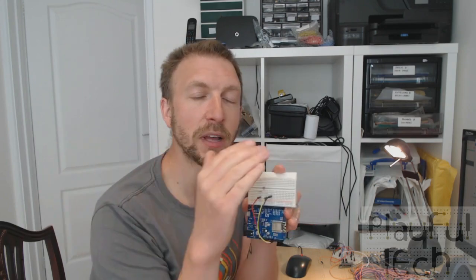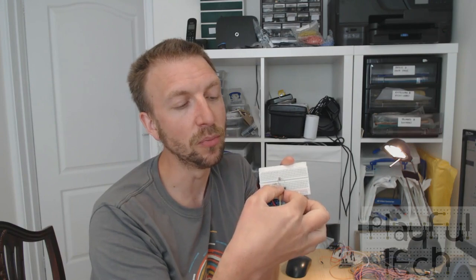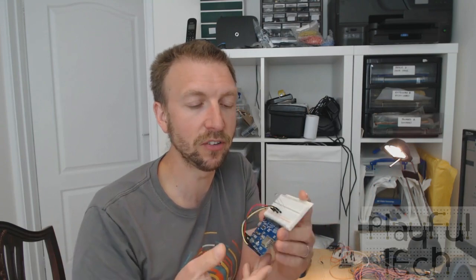To demonstrate this I'm going to use an example puzzle I've done in the past - a cover-up puzzle. It features a voltage divider created from a fixed resistor and a light dependent resistor. As you place your hand over the LDR, an analogue signal is read from the midpoint between the fixed and variable resistor, and the resistance will increase or decrease. When it is covered up by a certain amount, the puzzle unlocks. I've chosen this puzzle because it's nice and simple with only two basic components, but you could use this same approach for pretty much any electronic components.